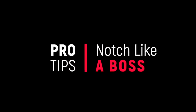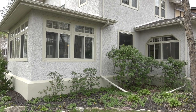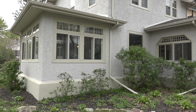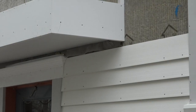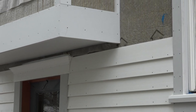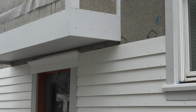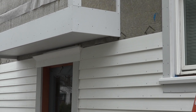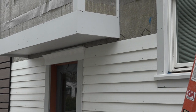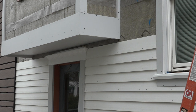It's not hard to see the appeal of cladding systems like stucco, which are basically liquid-based and flow, or at least smoosh, their way into tricky nooks and around complicated profiles. Like this classic head casing profile above a door in Minnesota. But that's only where the challenge begins on this particular piece of bevel siding. It needs to fit between two vertical trims, over a door, and under a cantilevered bump out. Oh yeah, and the top of the door casing slants at each end.